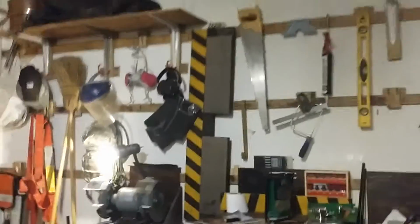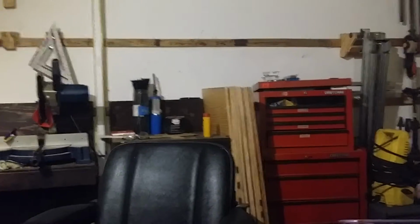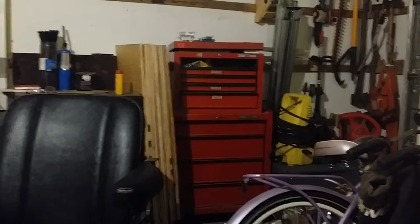I like to be able to make those bigger cuts on my own when I want to, as wide as I want to. You know, I usually cut them into 2 foot by 4 foot sections. There's my panels cut up. Those are pretty easy to work with, especially on a smaller table saw like this. A little contractor's table saw. Much easier to work with a smaller piece like that than a huge piece.